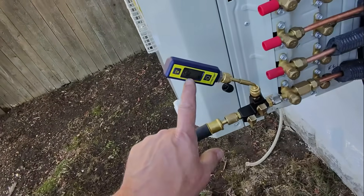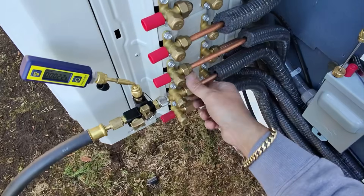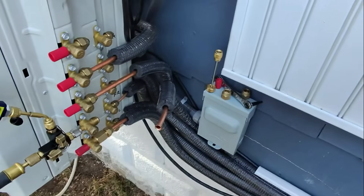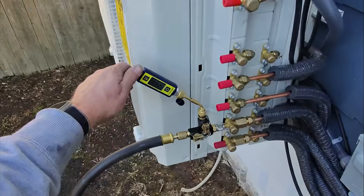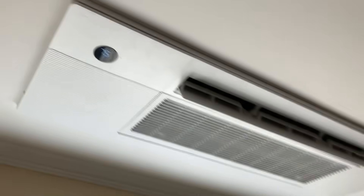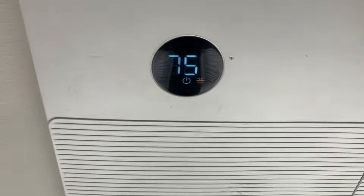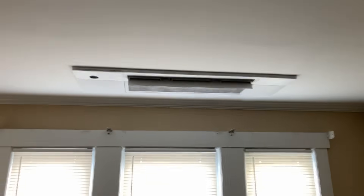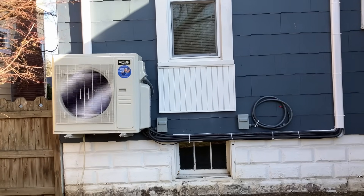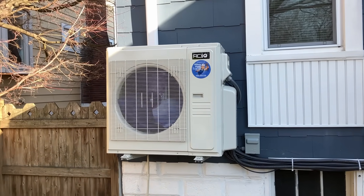After about five minutes we're at 195 microns — we're going to open up the service valves and proceed. Here's an unedited raw moment: I used the wrong one the whole time — take two. But wow, this is incredible — it even has a little heat icon right there to let you know the heat is on. The high wall evaporator looks beautiful too. I'm not too proud of that mistake, but we'll fix it when the time comes — just keeping it real.